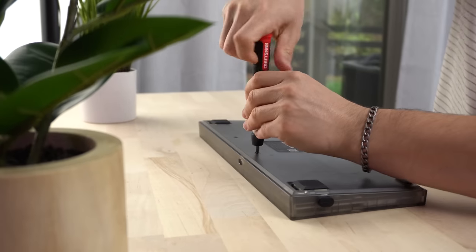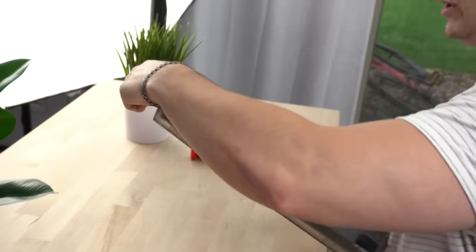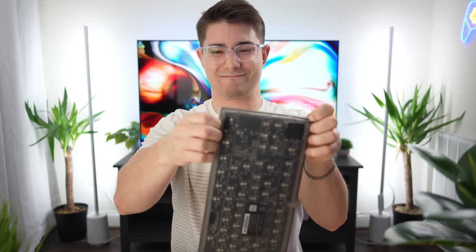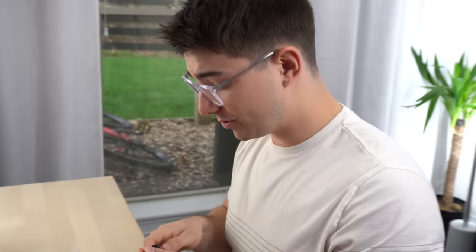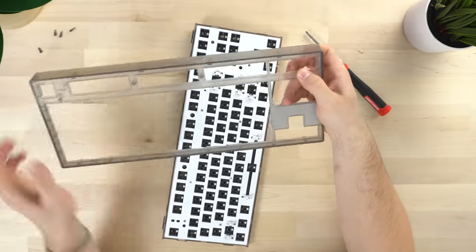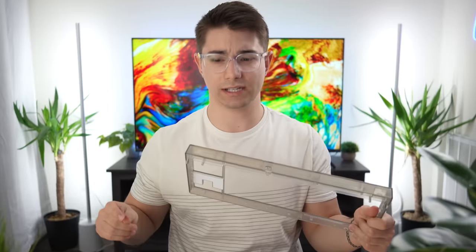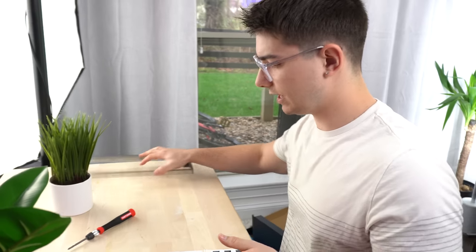Because I really want to get to know this board specifically, we're not going to do too many mods to it. All we're going to do is open it up. These screws are really tight. I think this pops off, so we're going to go around the edges. It sounds like I'm breaking things — and I cracked it right there. How do you take this apart? There are screws behind these standoffs for the flip-up risers — that's why it cracked. Learn from my mistakes: take off the screws behind the flip-up risers first. Now it comes off easily. It's a little cracked there. It's very similar to the TM680 actually — exactly the same.